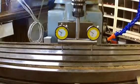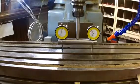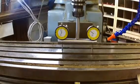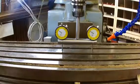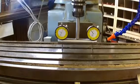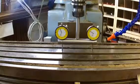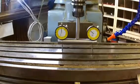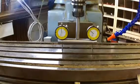If we bring the table up to zero, we should end up with double zero and we haven't. So something is miles out. When that one's touching, that one is about two and a half thou out.